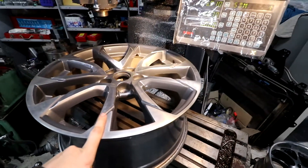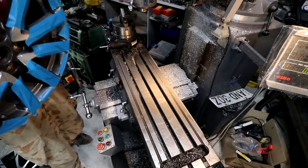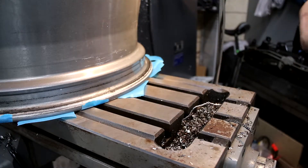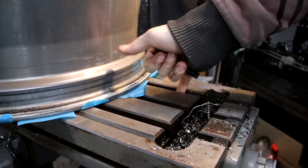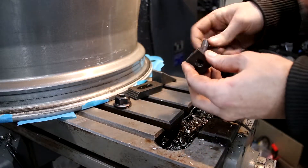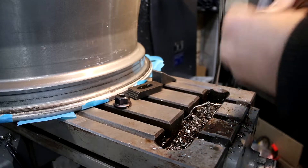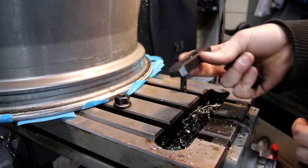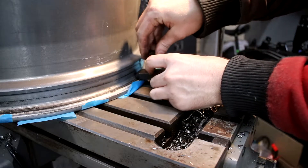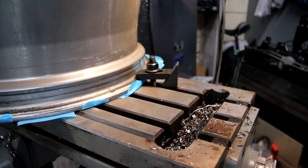First thing I'm going to do is bolt these down, face down. I'm going to put some masking tape to try and protect them as much as possible. Now that the wheel's on the table, we've got to hold it down. These slots here are a T-shape, like there's a lip on the inside. I've got a little clamp kit here — you buy these in a set, there's a bunch of different sized ones. These are T-slot nuts. You get the length stud that you need, slide it in under the T-slot, then get one of the clamps, slide it down, and the little teeth match up. Now I can bolt this down and it holds the wheel to the table as tight as I need. I'll put another couple around it and then we're ready to start machining.